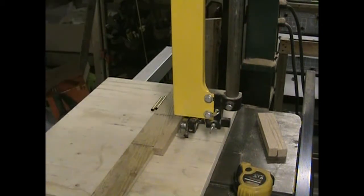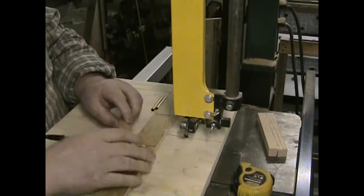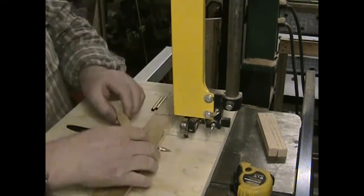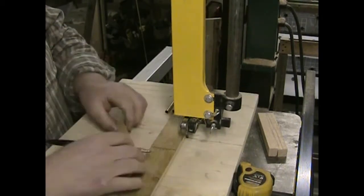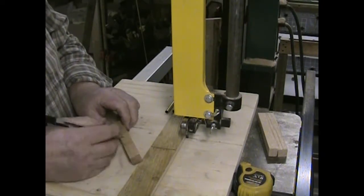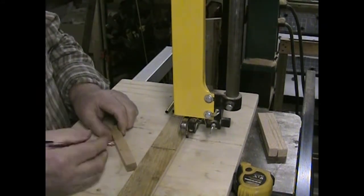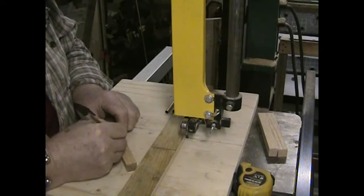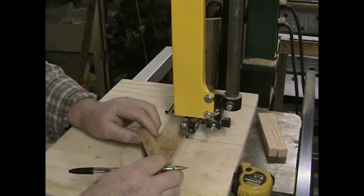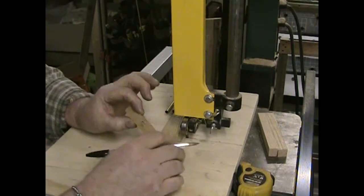There's one other thing I want to show you. I think everybody tells you to do this, but when you're sawing wood, and this oak, the figure is pretty much the same all the way through, but if you had something with some particularly nice figure in it, you would want to be able to mount it when you're turning it so that you can line up the grain and the figure in the wood. So a useful way to do that is, what I do, I like to write numbers on it. I don't put lines because two of them could look the same. So I would write a number, in this case 56, 56. So now when I've cut this in two pieces, I can put those two pieces back together, and any grain or any special figuring I can match up in the pen because I'll turn it with those two together.